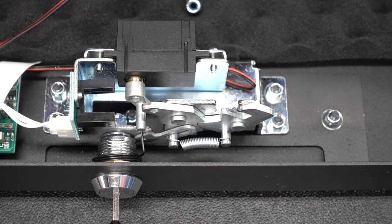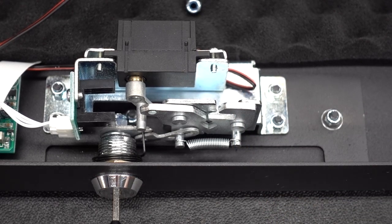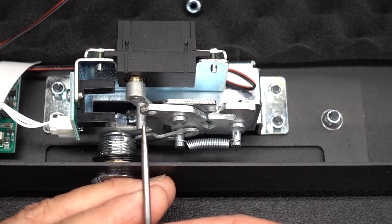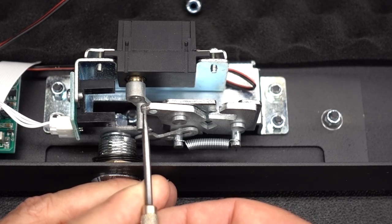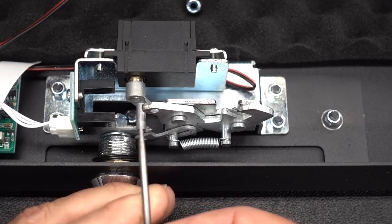The second possible exploit: if you were to drill through the top cover right about here, and then also through the inner protective housing cover — a quarter inch of steel total — you could possibly get a probe in there and manipulate around to hit that same part of the lever that the actuator from the servo hits, and get an open.